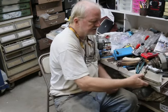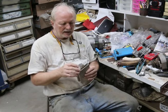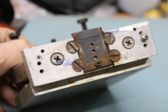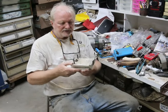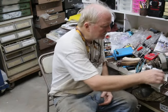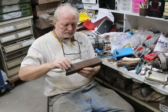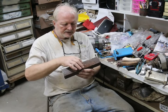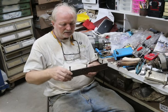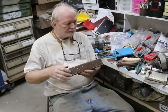The other one I made, I was trying to copy his design — he has some sort of device where he turns a screw and it goes up and down, adjusting the point. So I made a dovetail sliding thing instead; it's the same idea. This one has what looks like a stainless steel piano hinge, and the same concept: the hinge, you adjust the height here, and you lock it with a wing nut. I had to grind some bigger blades, so I did the same thing with a piece of angle iron — this is the face the blade clamps to — with a center pin, and you adjust the blade how you like and clamp it there.